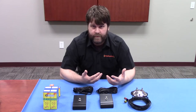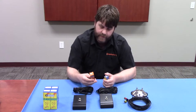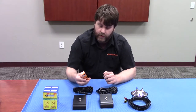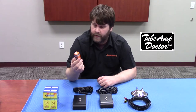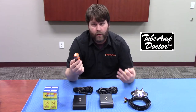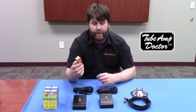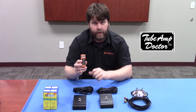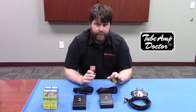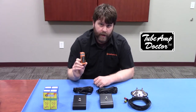Some people like to have it, and that's all well and good. So if you want tested balanced triodes, the best brand to go for that we carry would be the Tube Amp Doctor. They always test for things like low noise, low microphonics, gain, sonic test, shock test, and at the very end, balanced output. Hi-fi guys especially — because balanced triodes will make a difference in those situations for sure — you're going to want to go with the Tube Amp Doctor brand.